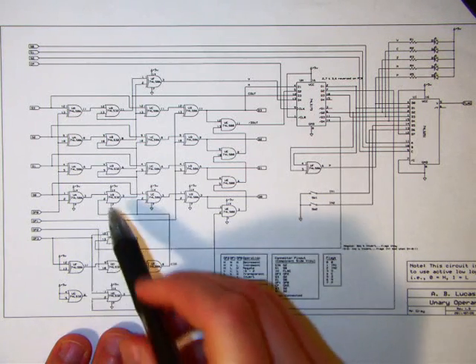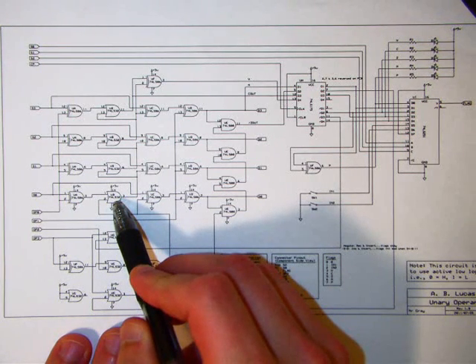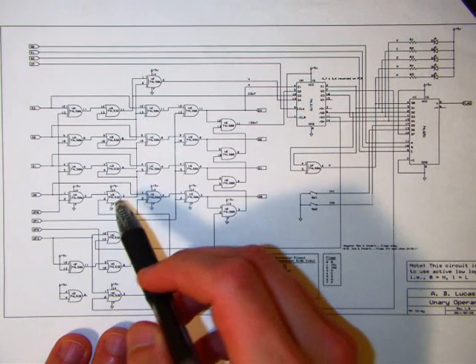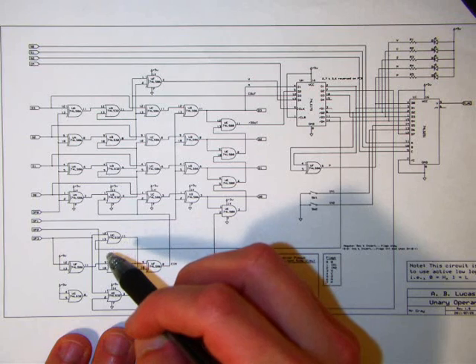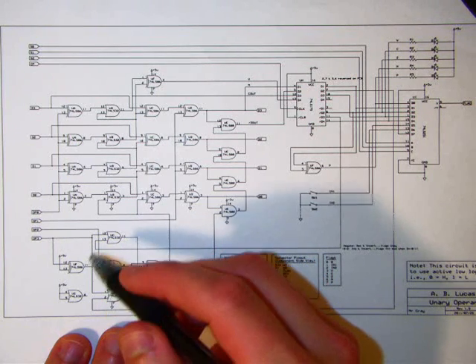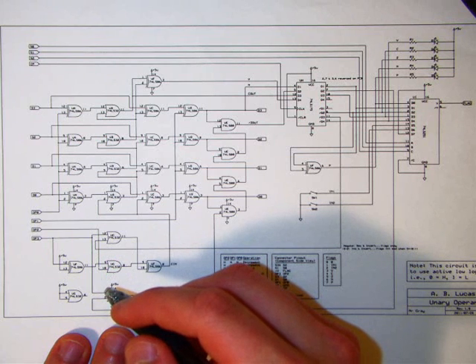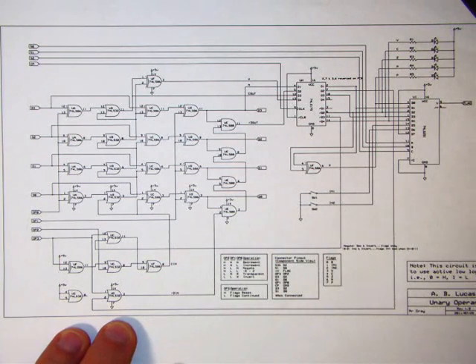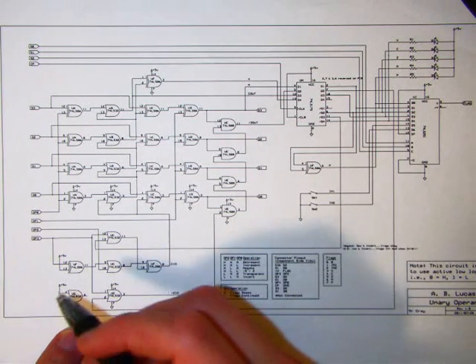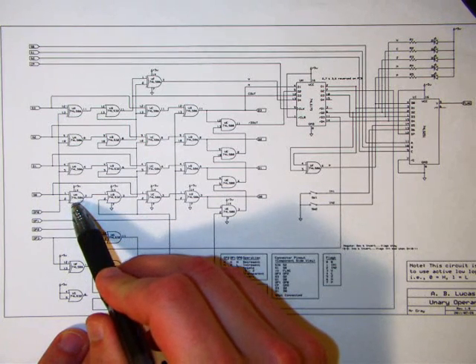On the input of each half adder we are able to invert our inputs. There's an exclusive OR gate on the input side and another exclusive OR gate on the output side of each half adder, and all of the control inputs of those two exclusive ORs are tied together. That gives us a control signal to control whether we're inverting the input or inverting the output.